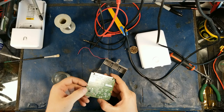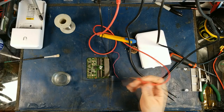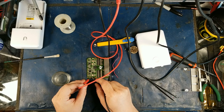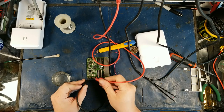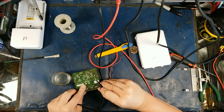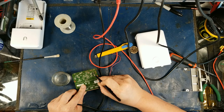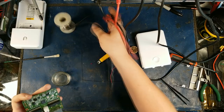Okay, so this is technically the AC side here and this is the DC side. Now it doesn't matter what side's positive. What the full bridge rectifier does is: one pin is designated positive, one is designated negative, and then the input side has a couple of diodes with positive flowing one way and negative flowing the other. These two pins go through a diode that comes out positive, and these two pins are connected to a diode that comes out negative. Simple as that.